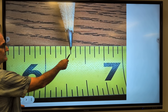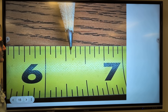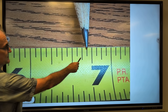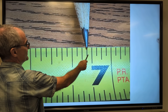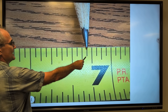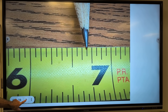Six — short line, so it's a sixteenth: one, two, three, four, five — six and five-sixteenths, or one after a quarter. Six — going to be a sixteenth; there's a quarter so that has to be three-quarters, or twelve-sixteenths; come back one to get eleven-sixteenths — six and eleven-sixteenths. Or: here's a half — eight, nine, ten, eleven — so six and eleven-sixteenths.